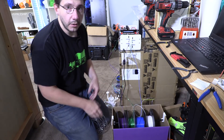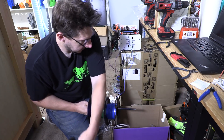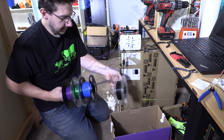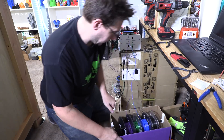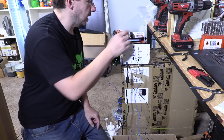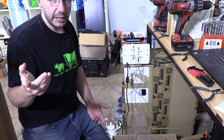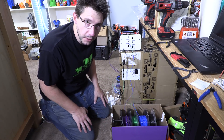I set it down. So here's how we get rid of the white from there. When you change out that filament, the screen asks 'do you want to change any more?' — I'm just going to hit no, and then it'll continue. Now it's going to heat the arm and rejoin the filament, and then we will be extruding more.